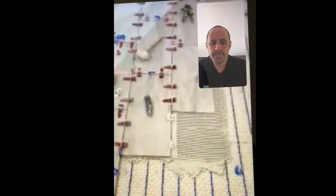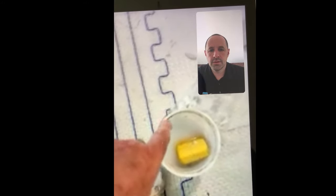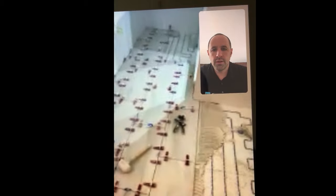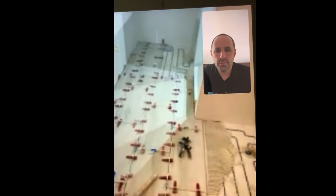Good. So you went with the 3-inch spacing on it. How'd that work out for you? Perfect. See over here, this area, I first had a line that went straight down, but I was about a foot, maybe 2 feet long over there. So I did this. No, this shouldn't zigzag. Came around, and then it was perfect over there. And I see the channel at the end. Yep, I put some thinset down and a piece of towel on top just to hold it so it doesn't get in my way tomorrow when I tile that area. It'll just be glued down with the thinset.